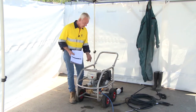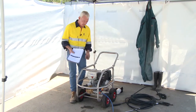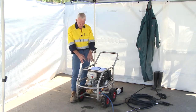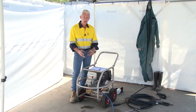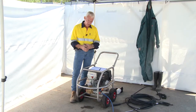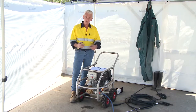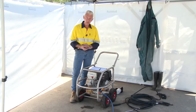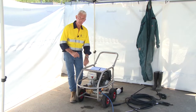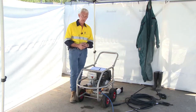These machines are easy to manoeuvre, easy to put in place, and quite adaptable to different situations. As far as water cleaning is concerned, the most important thing is water quality. We use tap water — potable water — which is drinking water. That's the criteria for clean water. You cannot set a pump up over a dirty dam and pump that water through, as it is detrimental to the mechanics within the pump head and will decimate the machine. Water quality is of paramount importance.